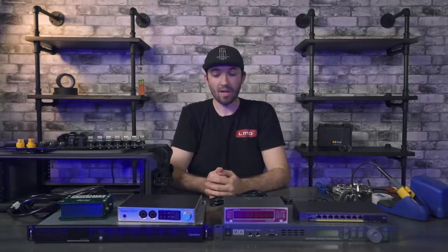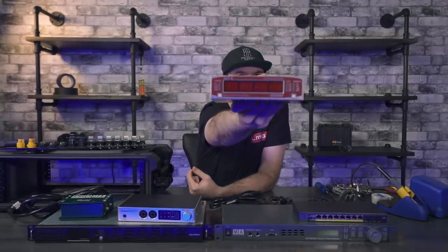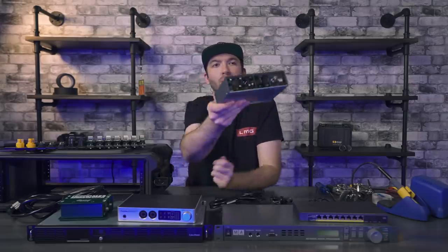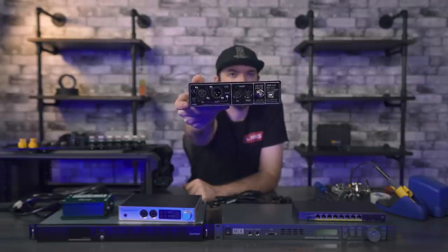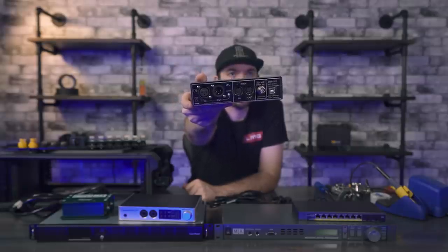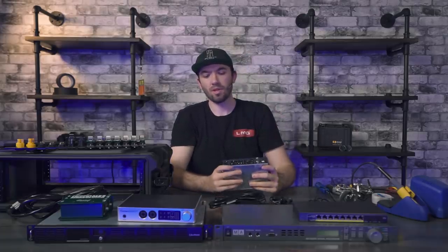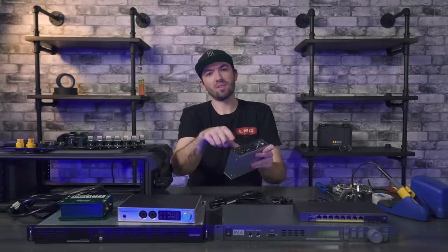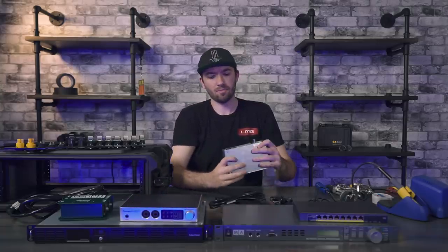Oh, this is a tough one. I think the next most interesting thing is going to be the MIF 4. This is a Rosendahl MIF 4. It's like a mini distripalizer. And if you look on the back, that becomes a little more evident. We have a couple of XLR ports on the back here, and those are SMPTE in and out. And then the most important part is this USB port. So this connects to a computer and then translates it to MIDI timecode and then regenerates our output and then spits it back out. So I can use this to not only go into MA, but then spit this out into our audio card, or excuse me, our audio interface.